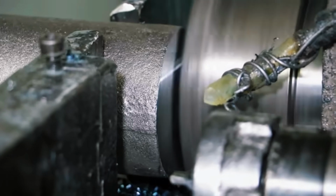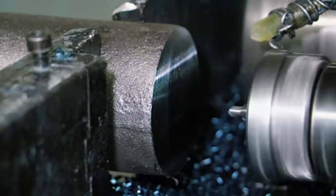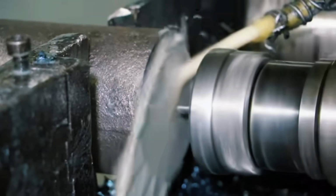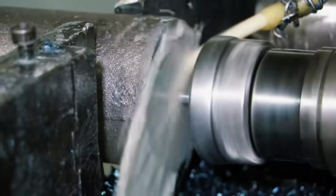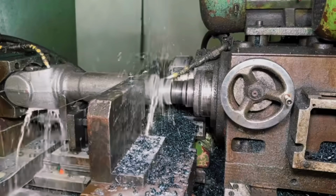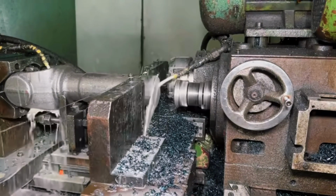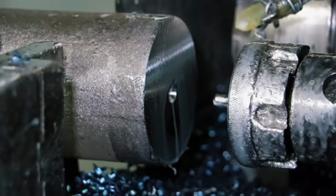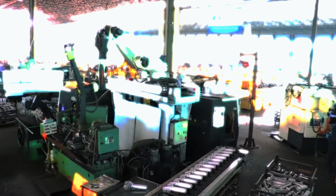The parts that have passed all inspections are sent to the assembly area. There, additional components such as flanges, bearings, seals, caps, and even electronic sensors that send information to the vehicle system are installed. Everything is adjusted with calibrated tools, following protocols for tightening torque, torque control, and assembly order. Once assembled, the axles are inspected again for looseness, misalignment, or functional failures.